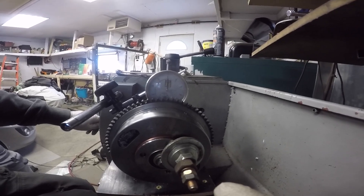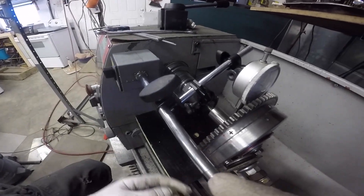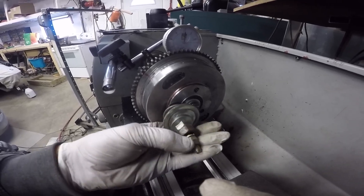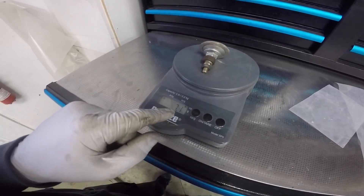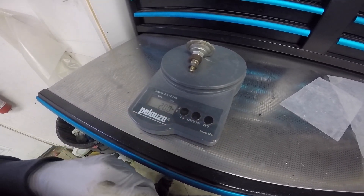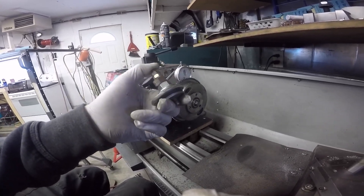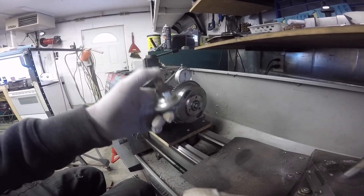It's pretty obvious that it's working — it's giving us the information that we want. I'm going to need to use a skinnier shaft and make it longer to make this practical. Because if we take all of this weight to the scale, we can see I have 7.1 ounces or 200 grams. So I'm getting about 4 thousandths on the dial extra with 200 grams. That means 100 grams would only give me 2 thousandths, and 50 grams would only give me a thou runout — and I need to be a lot closer than that.